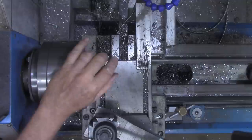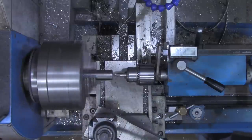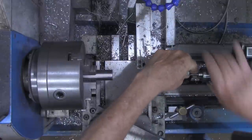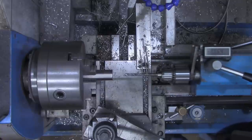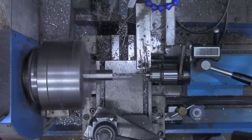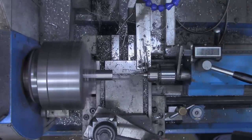I am going to ream this one. I have a half-inch chucking reamer. So just like before, we'll start with our center drill and go with the same quarter-inch starter drill. Could probably drill this half-inch without a starter drill, but I just kind of like to use one when I can. We'll set our DROs to zero, and we're going to come in an inch and a quarter.